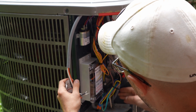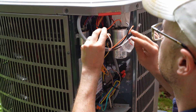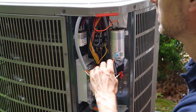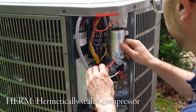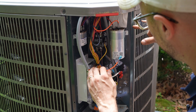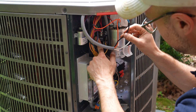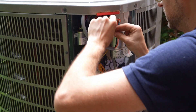I passed the whole wire bundle underneath and up through and all the way around so that these wires are just going to connect to the rest of the system. Let's have a look at the instructions for the Easy Start and see what they say. First step is connect the orange wire to the Herm terminal of the compressor capacitor. This is the capacitor - the Herm terminal would be this one because according to the schematic, this orange wire is what goes to the compressor. So we're going to plug this in on the same terminal bundle here. Next, I'm going to connect the black wire to the common set of connections on the relay, where some of the other black wires are meeting up.